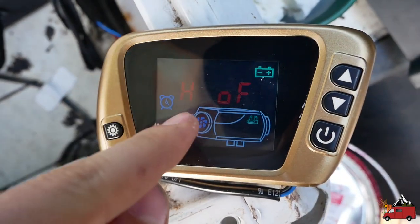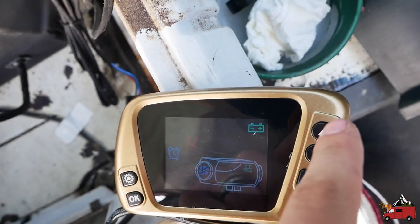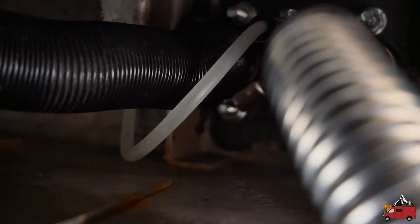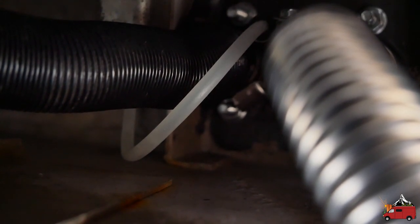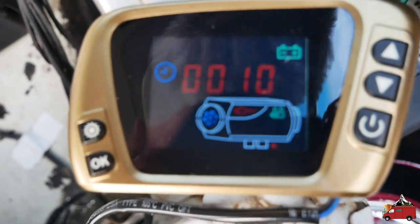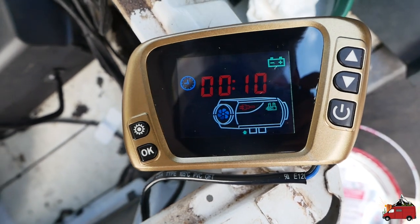I'm about to prime the pump. All I did to get to prime mode is hold down the settings button and the down arrow — it'll say HOF. Push it up and it'll go to ON and start pumping. The heater is firing up now — full air coming out of it but it's cold. It takes about two to three minutes for the thing to really fire up and get going. That's it for this week's video — thank you so much for watching. If you got any value from this please hit subscribe, give this video a like, and tune in for next week's video.